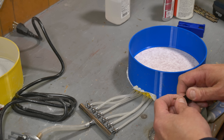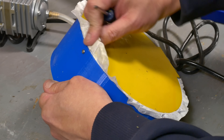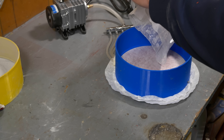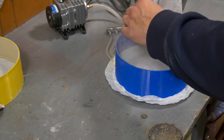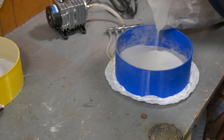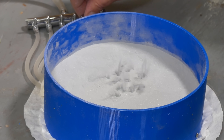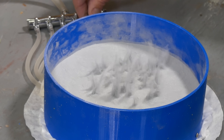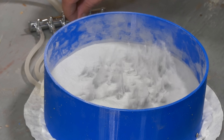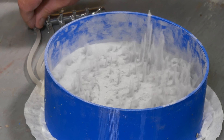The last thing I've got to do is put a couple screws in this to hold it together. That's the center. Ideally, you want the air to lift the powder enough to make it float. When you get these plumes of powder, it's called channeling, and that's not really what we're going for. It's quite a balancing act trying to get the right amount of air for the powder.